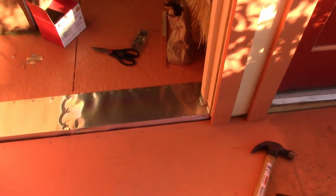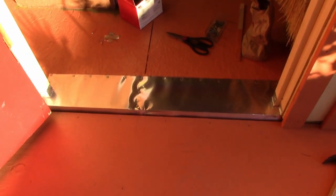That is my homemade threshold. Too bad I couldn't have done something more like that. I didn't put a threshold here — I thought all that paint I put on there would protect it and the floor wouldn't swell. I was wrong. OSB absorbs water like a sponge, so don't use it in an area that's exposed — that's the moral of this story. And the door closes, no problem. You don't hear anything rubbing. My job here is done.